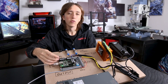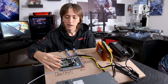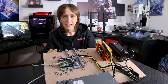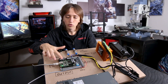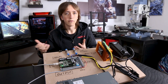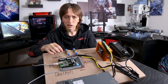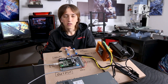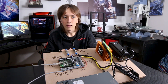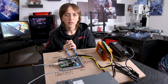This green PCB that you can see here is the Smooth Stepper Ethernet version — it is the controller board. The board underneath it is a breakout board. This basically takes all the different signals that you can control and breaks them out, making them available for all the different functions on my CNC machine. I could just use the controller board itself and connect to its tiny pins, but then I would have to add my own electronics in between. Using a breakout board makes this a whole lot easier.